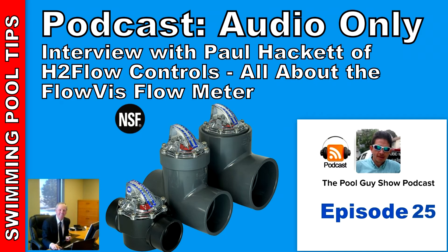You mentioned gallons per minute and liters per minute — for people with pools not in the U.S., can they use a FlowVis flow meter? Actually, what we've found in the European markets, and now as we're entering the Asian markets, is that many of the pipes there are different sizes to what we're familiar with in North America. We're used to imperial-sized pipes — inch and a half, two, two and a half inch, and so on. In mainland Europe they use metric piping sized in DN40, DN50, DN65, DN80, DN100, and so on. You cannot take a standard imperial-sized valve body and use metric pipe on it, so here at H2 Flow we've developed FlowVis models for metric piping.